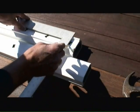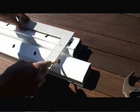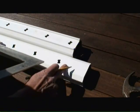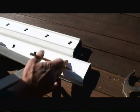Now we're taking the top rail that we just cut and lining it up with the bottom rail, also lining up the center of the baluster holes with each other. Then we're simply going to mark with a pencil on either side of the bottom piece where we need to make our cuts, so we have a nice even width rail section between the top and the bottom.